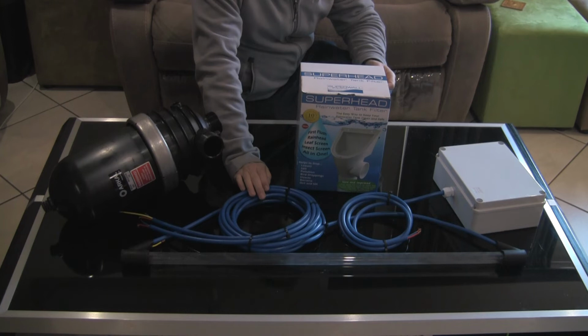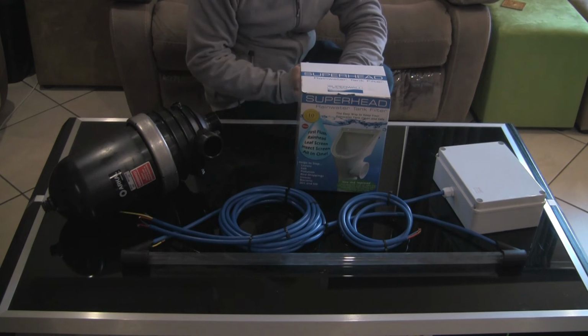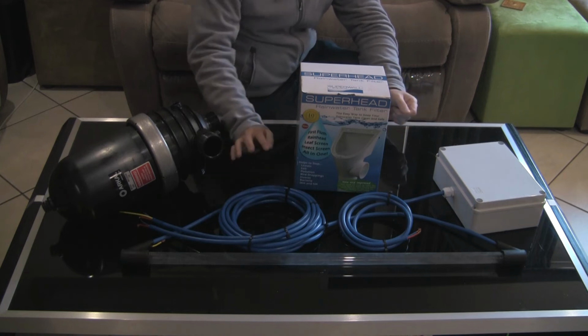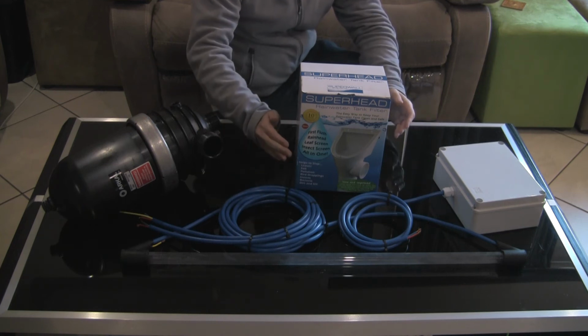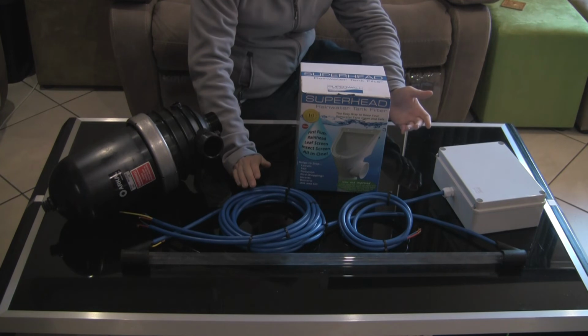Typically we'd say it can be on a normal timer just for 4 to 6 hours a day if it's backup water. What that would do is just every day kill any bacteria that's starting to build up in the tank, thus giving you a long lifespan for your backup storage. If you don't have something like this in place with backup water, you typically get to a point within 2 to 4 weeks where you actually have so much bacteria in the water in the tank that you pretty much overwhelm any filtration system that you would have after the tank,